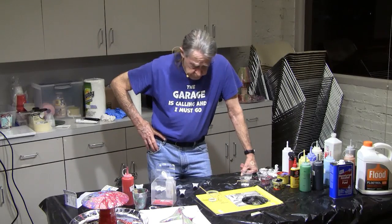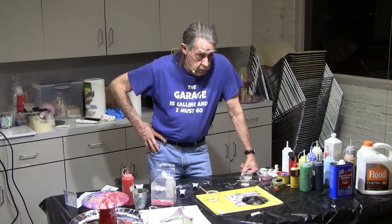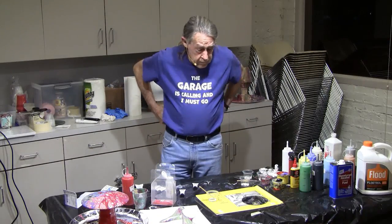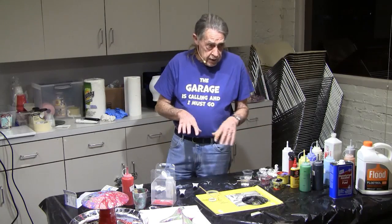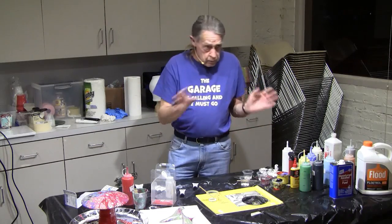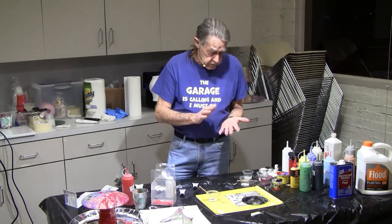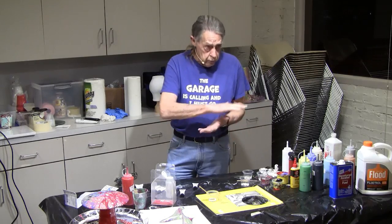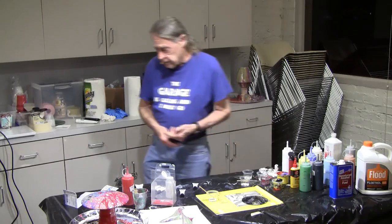I recommend that you create your bowl first. And you want to have it sanded down very fine. You want to put your accents. You don't have to put the accents on it. And you don't really finish the inside of the bowl, because the first thing you're going to do is paint the whole thing solid black. And once you've got it painted black, you can fine sand it with 1200 or 2000. Put another coat of black on it. Sand that down real smooth. Put lacquer on top of it.